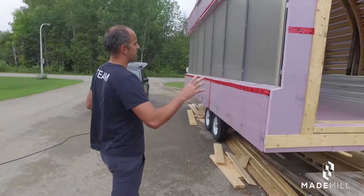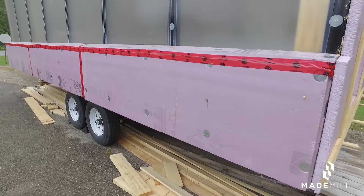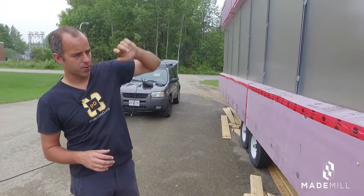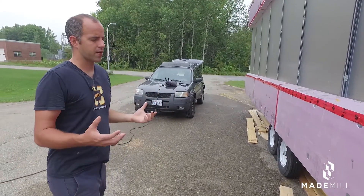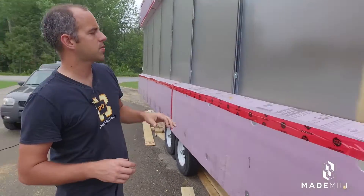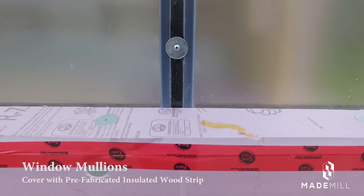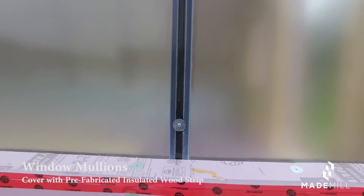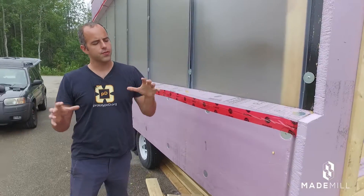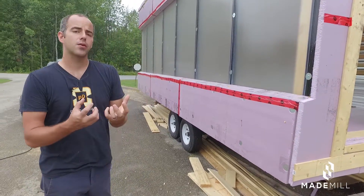We've come across the front and we've applied all of the rigid foam insulation to the bottom and to the top, and we're doing all of our trim framework around where we'll attach all of our flashings and metallic finishing. The last element to do here is we're going to be covering over these window mullions with a prefabricated insulated wood strip, and that's really the final step in fully enclosing this building.